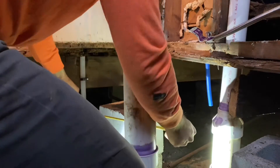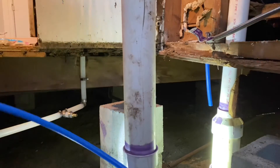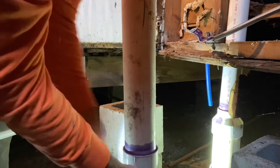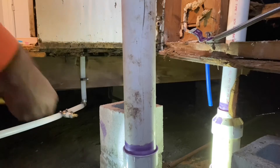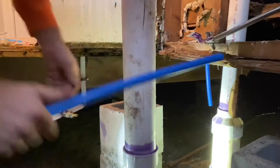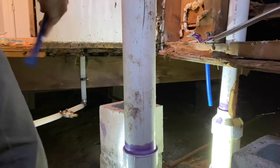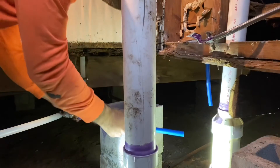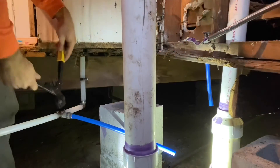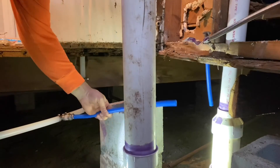I'm going to go 18 inches. Take a piece of this pipe - because it's round like this it's rounded, so I just stretch it out and make it straight. Then I take the measuring tape - 18 inches, right here. You can straighten it out till you're happy. I'm happy with that. I'm going to get a crimp ring, put it on there, and stick it on the pipe. Now that we're at half inch, I'm going to tighten this down. Now that that's tight - it's blue so we know it's cold water.